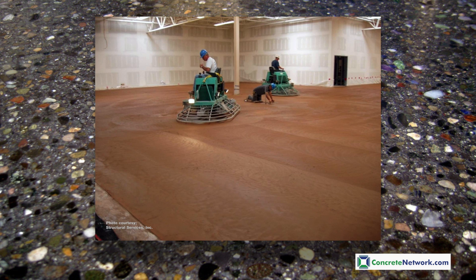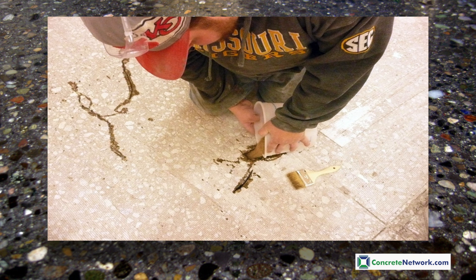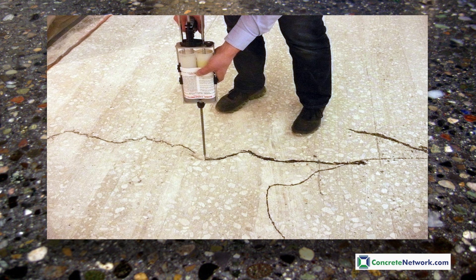There should be a close examination of your floor to find out if it is a good candidate for polished concrete. There are many variables that can play into determining if you have a desirable canvas to polish, starting with the mix design of the concrete, how it is placed, finished, and ultimately cured. Often times, there can be so many surface blemishes and imperfections — like this divot in need of repair — that the decision will need to be made to move forward with refinement. It is important to understand that cracks will not disappear. However, with proper patching materials and techniques, most blemishes can blend nicely and not be as noticeable. It is important to set realistic expectations of what can and cannot be achieved with the polishing process.